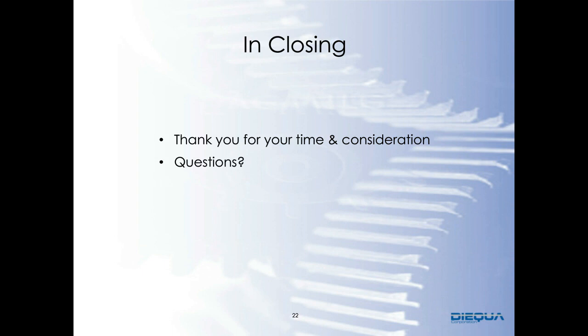The next we have is, what backlash can I get from your Servo Worm reducer? So the very basic version out of the box has a less than 10 arc minute of backlash. We also offer two smaller backlashes available, a less than 5 in the medium, and in the expert, a less than 1 arc minute of backlash. And that's guaranteed through the 20,000 hour operational life of the reducer.